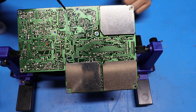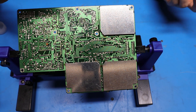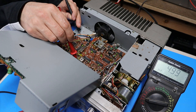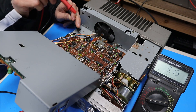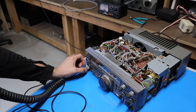I've got all the solder joints under VCO5 reflowed — hopefully they're all better than they were. Now I'm going to throw the board back in the radio and see what happens. As you can see, I'm now probing test point 11 and I'm getting just about five volts, which is where we want to be according to the manual. So I think VCO5 is straightened out.